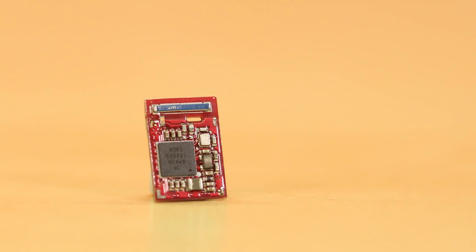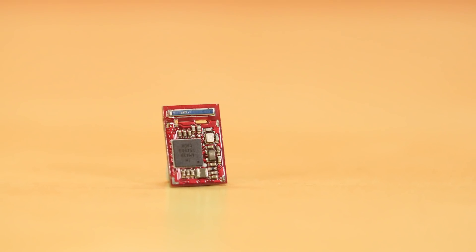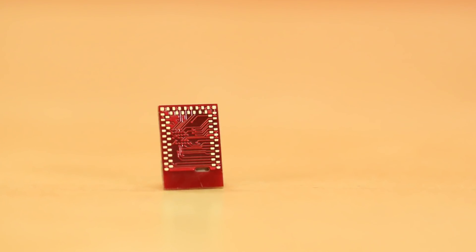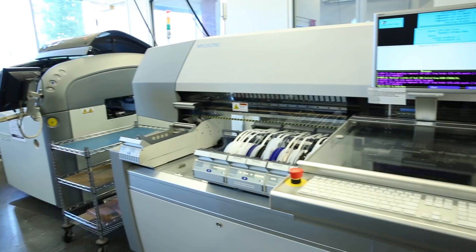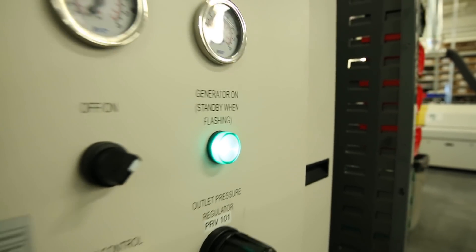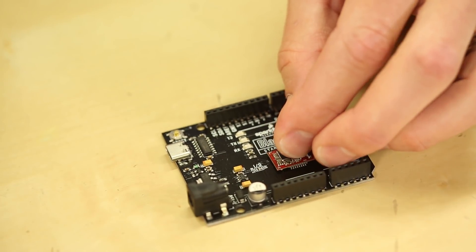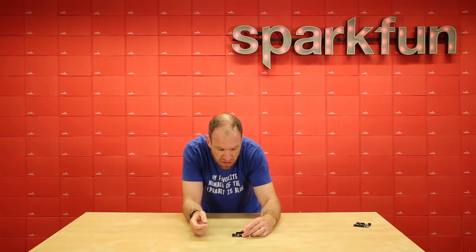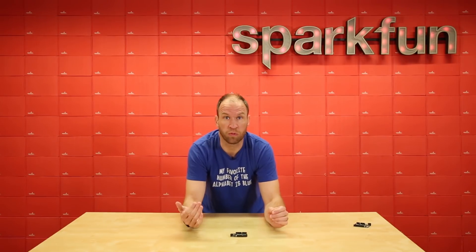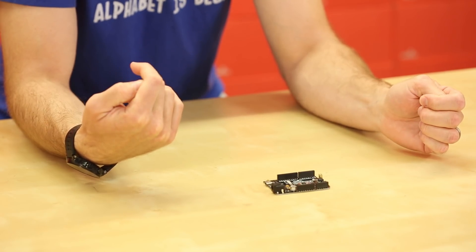But what if you create something big? Something that people may want to buy en masse. This is where the traditional Arduino breaks down. The ATmega328 is great, but it's incredibly painful to go to scale with. With a BLE radio and extremely low power, the Artemis can power your most demanding designs. We're producing production volumes of the Artemis ready on tape and reel, available from SparkFun as well as all your favorite component vendors. This is a modern architecture with modern debug tools and SDKs. And look at that — it's roughly the same size as the ATmega328, so you don't have to give up PCB real estate to implement a Cortex M4F with BLE. You can upgrade your designs and have additional flash space, additional power, all the things you would expect with a modern microcontroller.